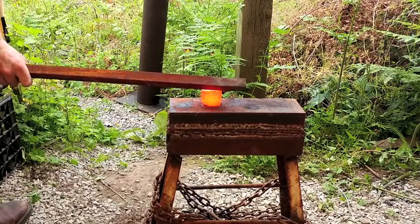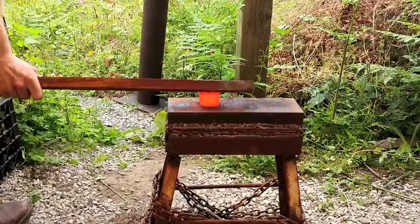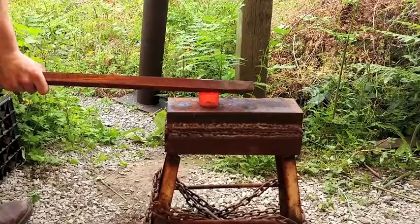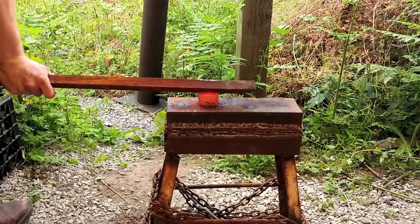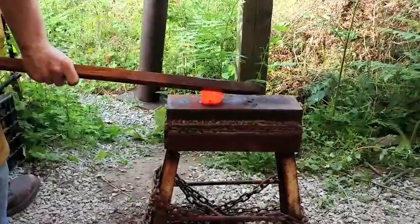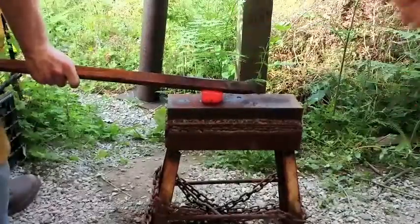One of the last parts is to put in the V — that's what this was meant to do. So I'm using a piece of one inch just mild steel as a way to put in a right angle V groove into the swage block hardy. Just checking to make sure it's going in correctly. It may look like I'm doing this at an angle but it's just the angle of the camera. Unfortunately the hardy tool itself wasn't completely parallel to the sides.